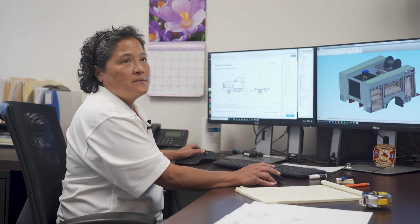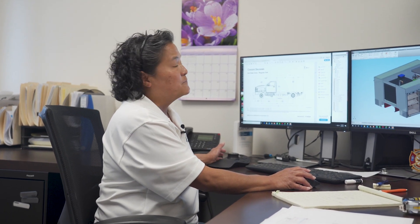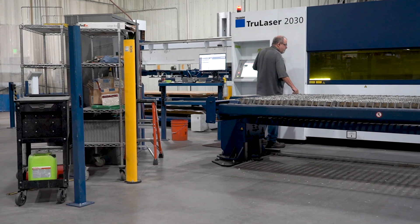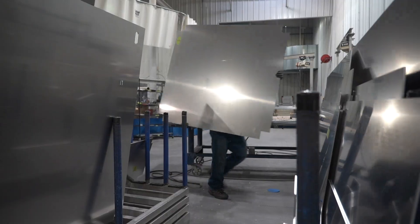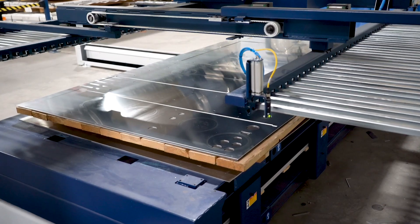Once that's approved, we release all of the sheet metal to our laser and water jet and cut it, and then of course we go on to the fabrication process. At the start of the fabrication process, we have our laser cutting and water jet cutting. Our laser and water jet cut all of our steel, stainless steel, and aluminum. This laser delivers tighter cutting tolerances than the standard turret punch, and we're able to run 4,000 pounds of sheet metal in one run to deliver hundreds of thousands of intricate parts these custom trucks require.